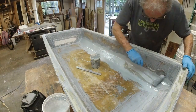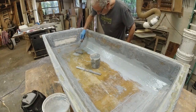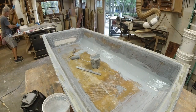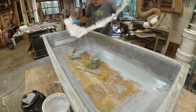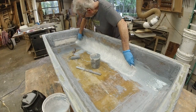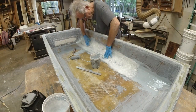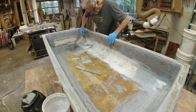I just wasn't happy with the way this stuff was setting — it must have been old, or somebody left the top off for months, or mixed the wrong thinner with it. It never cured hard to my liking. So we got some different epoxy and it worked perfectly. Laid up a bunch of layers of cloth, put in some rigid fiberglass sheets as bracing, glued that using the gray epoxy paint, and put some more cloth over that.